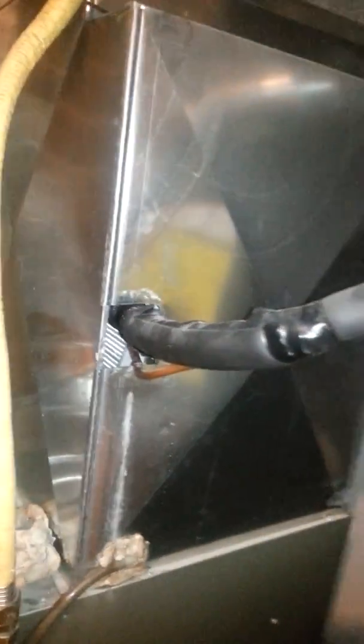The plenum is only 19 inches wide. So not a bad idea turning it 90 degrees like that. Maybe we'll do the same thing and use a C-width coil.